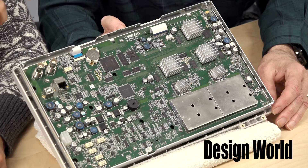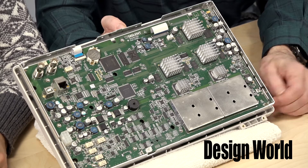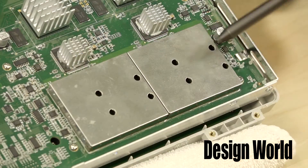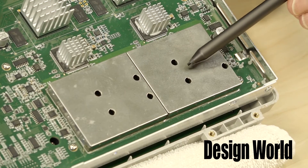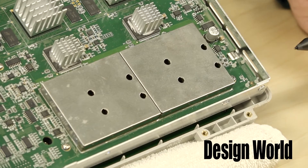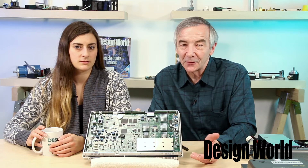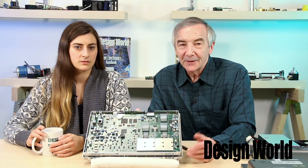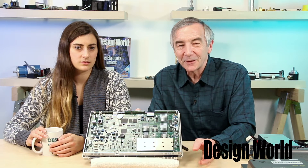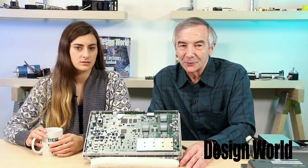Now, I also see a big metal shield below the chips with the heat sinks. You're right. That metal shield is over the four input connectors on the front of the scope. There are eight holes in the shield that give access to trimming capacitors. They let you tune the scope input network so it looks like a 50 ohm load to the incoming signals you're trying to display. You have to shield the inputs this way because they can be pretty low-level signals, and you don't want them to get garbled by some of the other signals floating around on the board before they get sampled and displayed.